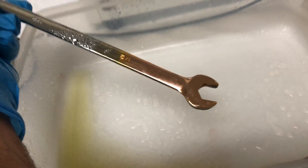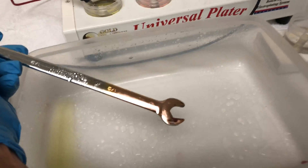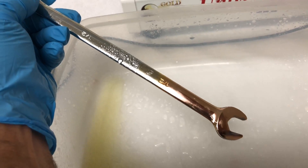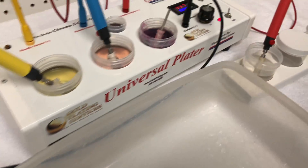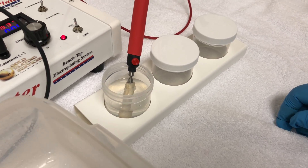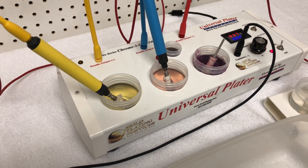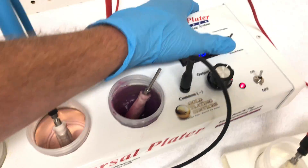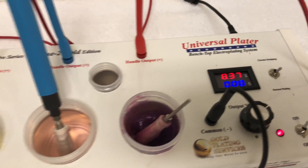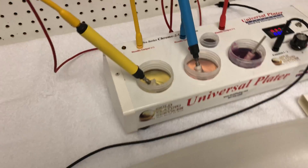You yellow gold plate something and then put on the rose gold, and you've got your piece done. That really shows you how simple it is with the Universal Plater Chrome Edition — it's a really good kit, really easy to use. If you were going to continue on the rest of the wrench, you'd do like we've shown in other videos, merging two sections together, always doing small sections. The auxiliary working beaker holding tray is around $19.95. The Universal Plater Chrome Edition — not to be confused with the regular Universal Plater — has the ability to switch between chrome stripping and normal plating. You only ever flip it to chrome stripping if you're actually stripping chrome; everything else is done in normal plating mode. Hope you guys enjoy!